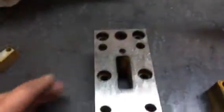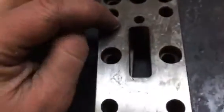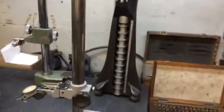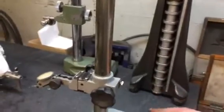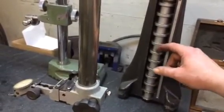Now I have to grind the punch that slips through this window. Right now I've just got it rectangular — I actually have to grind these rads on the corners of the punch so it'll slide through. Here I have a precision height gauge; it's called a Cadillac, and that's just the slang name for it. Off the surface table, these are little tabletops and they're exactly one inch separated.